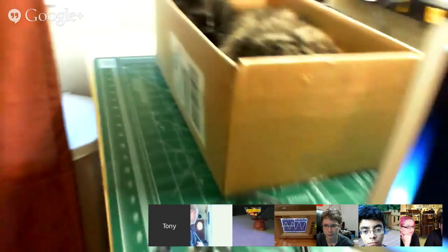Tony, what you got cooking this week? So I've been playing with the AHRS system, which is the Attitude and Heading Reference System. It's basically a way to take accelerometer and magnetometer data and spit out orientation, because the raw data you get isn't really directly mapped to an angle that you're facing. These are little boards like the 10DOF board, and the cat is right there.